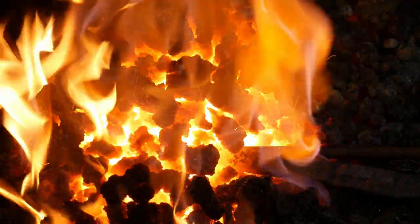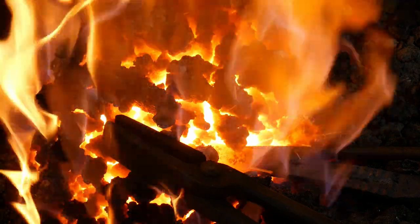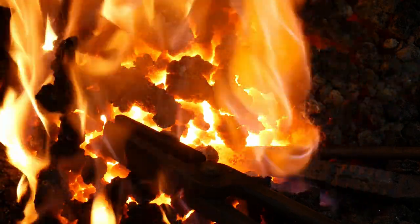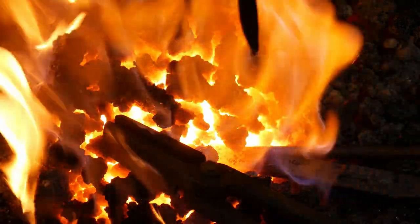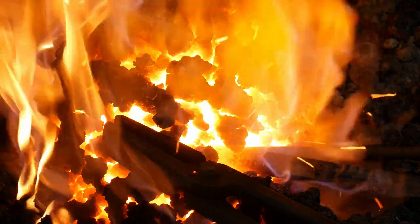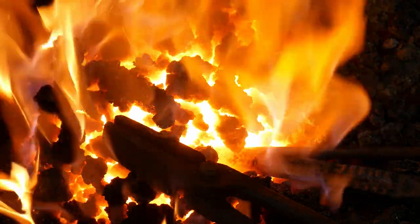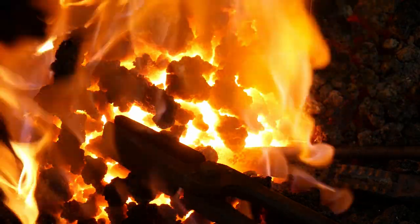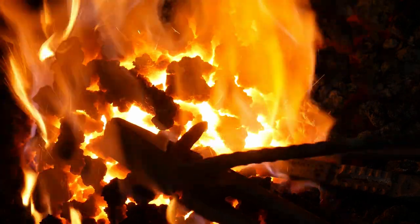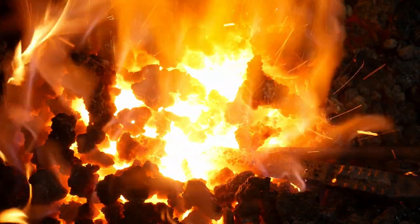We're going to keep it covered, and we want the tips of these tongs to stay warm. It's really hard to get welding shots inside of the fire without getting in too close. Bring this whole piece back up to temp. We're just trying to watch and mitigate burning right now as I'm talking you through this process. Now I'm going to go ahead and move some of this top coal — this coke — out of the way just so I can start seeing the piece.